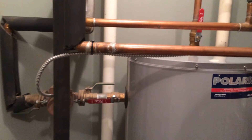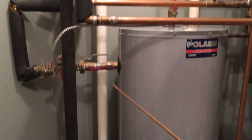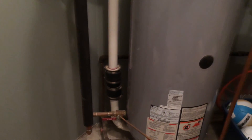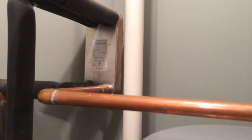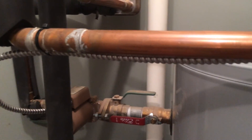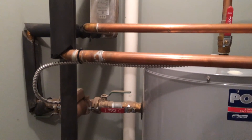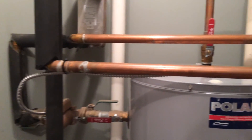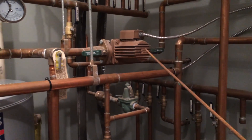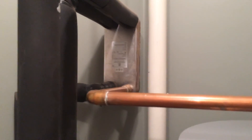Now what I have is what's called a closed system. Water in this tank just circulates between that there and down here at the bottom, circulating through that heat exchanger right there. There's a pump right here that's wired into the same controllers that control the pump for the rest of the heating runs for the tubes. Whenever there's a call for heat, that pump will go on as well as the pump over here supplying all the floor heating system.